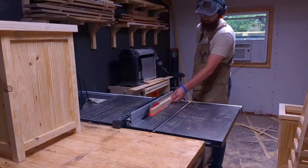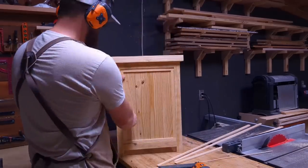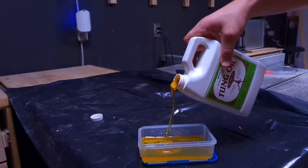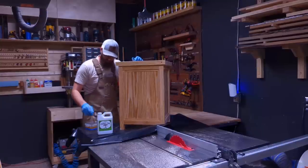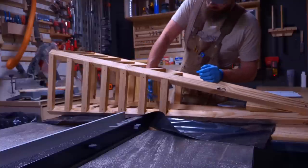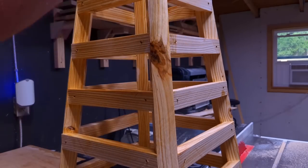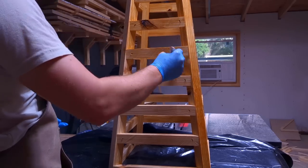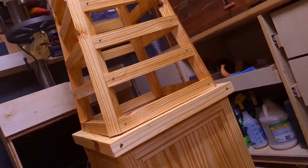The trim is just made out of the scrap that's left over. I'm cutting it a quarter inch thick by three quarter inches wide, laying it out in place, and tacking it down. Now, this tung oil — I'll have a link in the description. It is 100% pure tung oil with no other chemicals. Tung oil is a good exterior finish; you do want to put a couple of coats. It takes about a day for the wood to absorb the tung oil, then you etch it with a high grit sandpaper or a scotch-brite pad and put your second coat. I'll leave the base open because when somebody puts a plant in this box it's going to be inside one of the planter pots, so you don't need a solid base — they're not going to fill it with dirt. Last thing: do not attach the obelisk to the box until you deliver, because they need to be able to put the plant inside the box. Pre-drill the holes and give them some screws so they can attach the obelisk themselves.